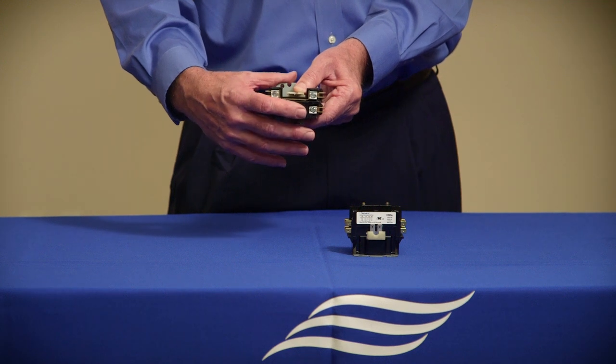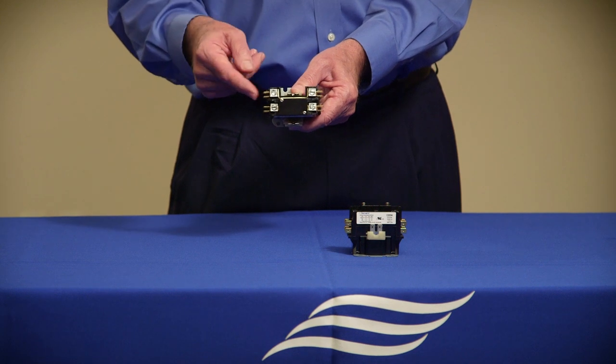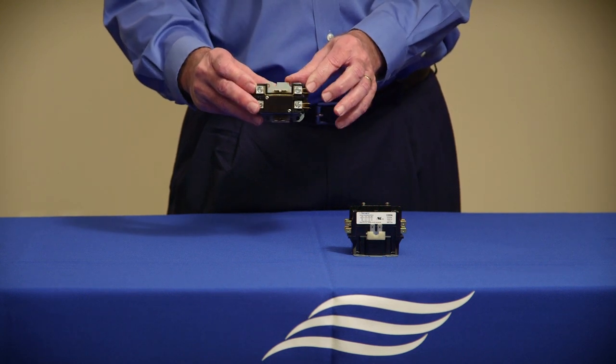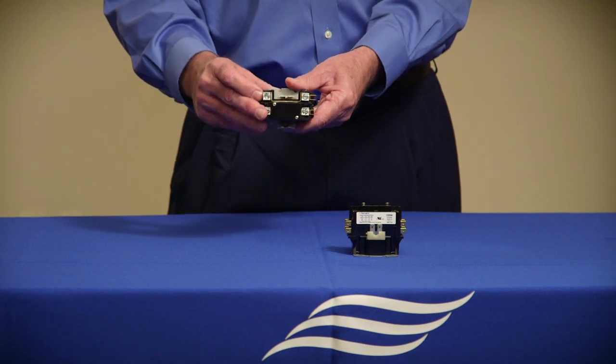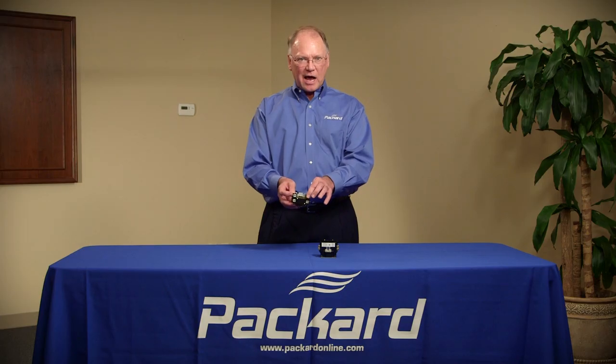But there is something additional on that contactor called a shunt. The shunt allows us to keep a circuit through this leg of the contactor at all times — it's always hot.